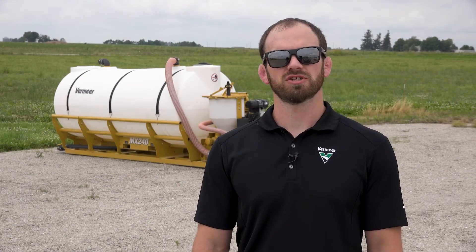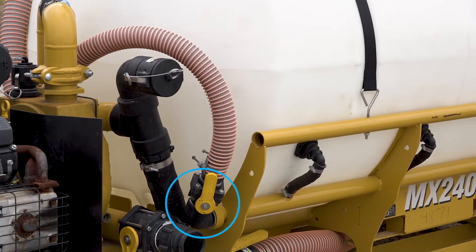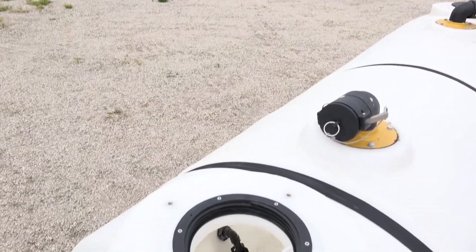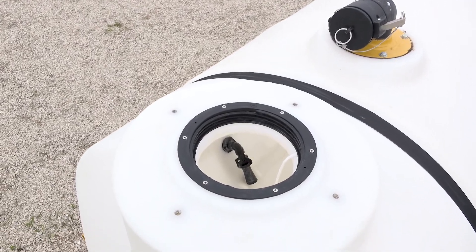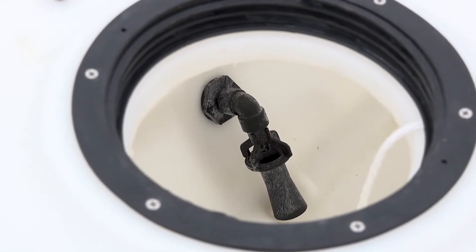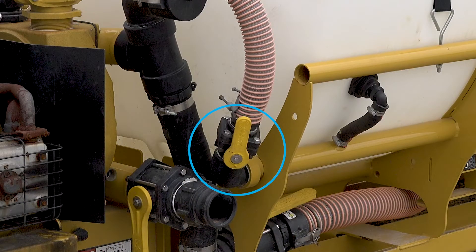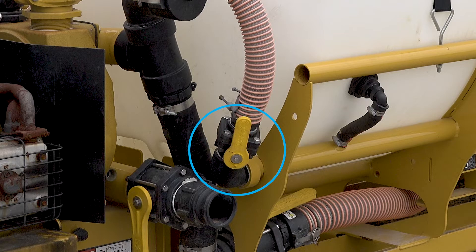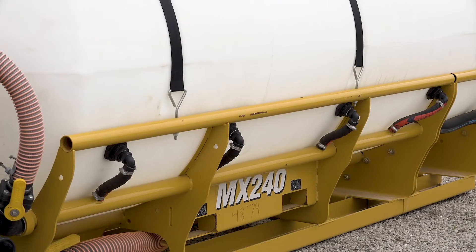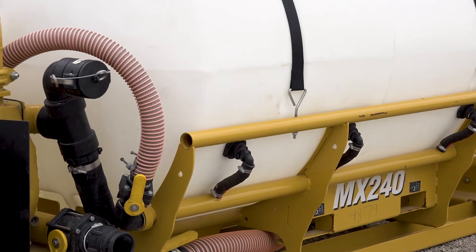The second way the fluid can be discharged is through the nozzles. As I follow this hose past the roll jets valve, it runs through this tube which is then connected to the nozzles on the inside of the tank that are angled downward. When the fluid runs through them, they create a circular motion inside the tank to help keep fluid agitated and assist to continue the mixing of the drilling products. Before starting the machine, the roll jets valve needs to be open to allow a path for the fluid. As soon as the engine is running, this machine is sucking fluid and discharging fluid, so having the roll jets valve open is also the ideal path for discharge.